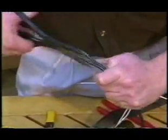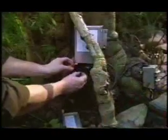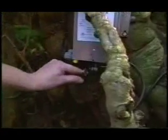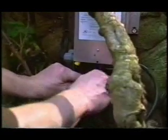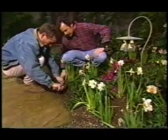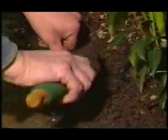According to Randy, you can buy low-voltage wire at any lighting store or electrical distributor. Once the ends of the wire are exposed, you simply screw on the wire nuts. Randy says another nice thing about a low-voltage system is you don't really have to bury the wiring down deep like you would with standard 120-volt wire.